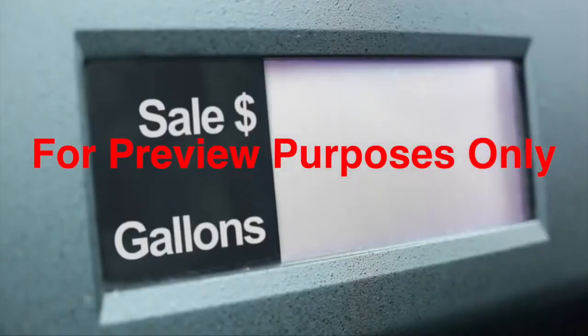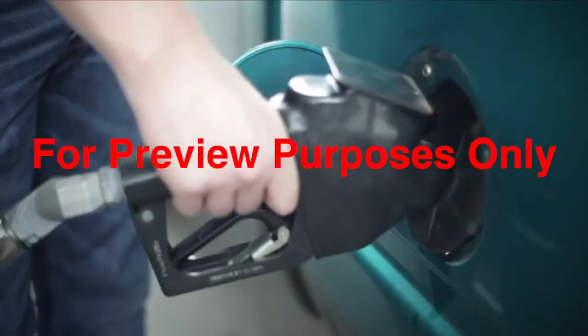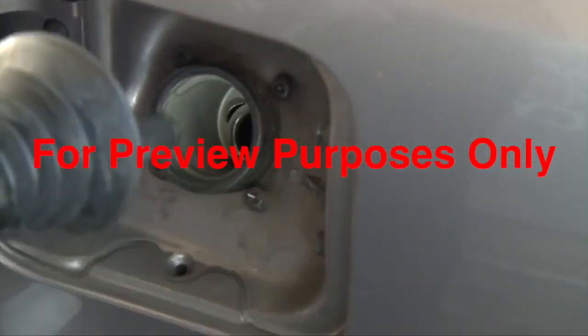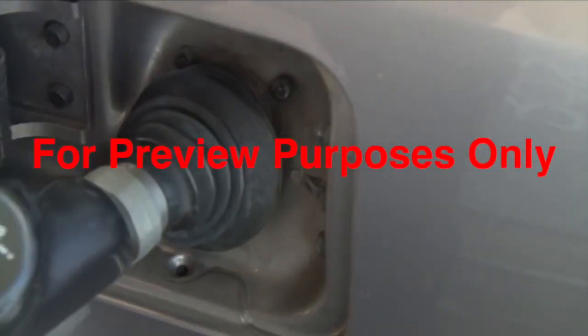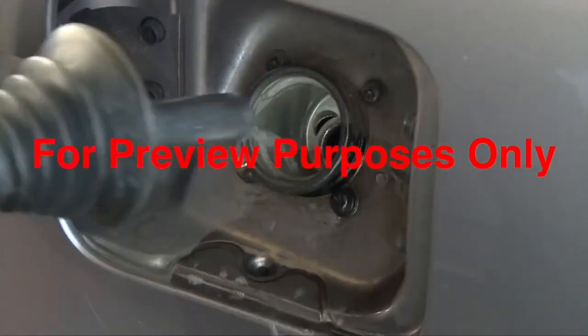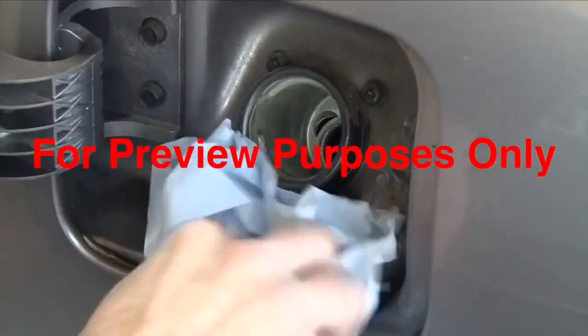Refueling a forklift that runs on gasoline or diesel fuel is fairly straightforward. It's pretty much like filling up the gas tank in a car. For added safety, touch the nozzle of the hose to the truck's fill pipe before you start transferring fuel. If you spill any, wipe it up and wait for the residue to evaporate before you restart the engine.